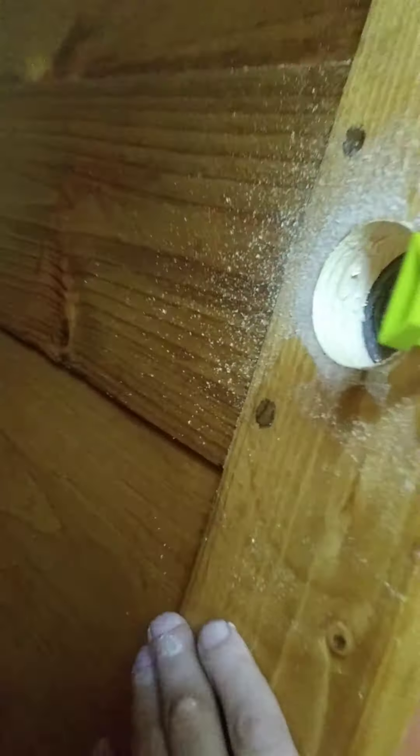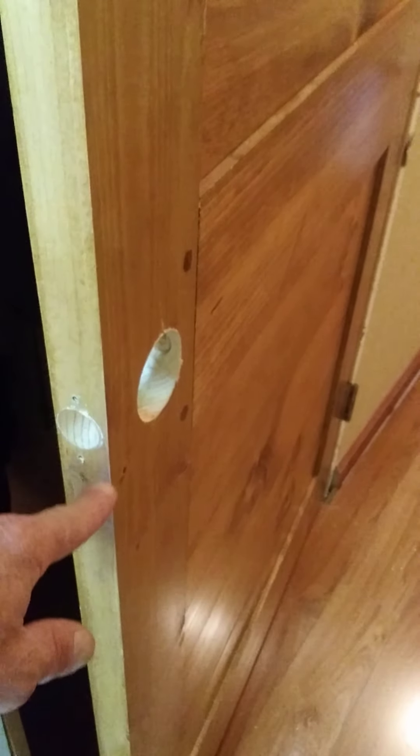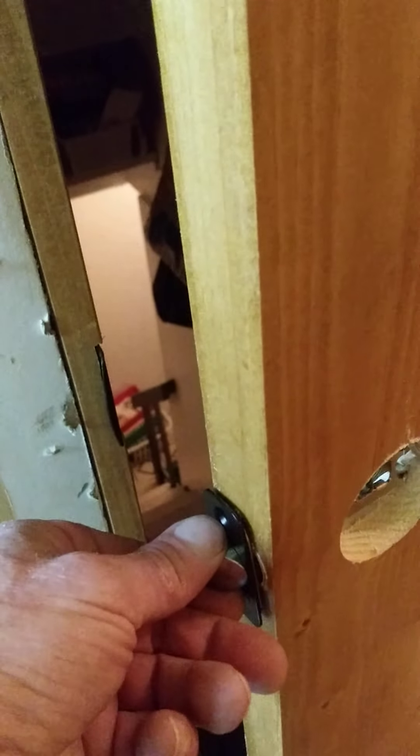So I'll go ahead and be putting the doorknob on, and I'll be back soon with the rest of this episode. Actually, I made a mistake — when the bolt goes in, I have to route this out with the bolt plate template so that the bolt fits in flush. It has to go in about another eighth of an inch to fit flush with the door. So this will be on to the next episode, part three and the final part. Thanks for watching, and please subscribe to my channel. The next episode is coming up in a minute.